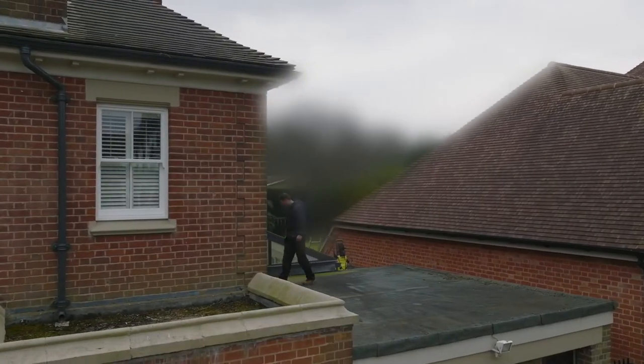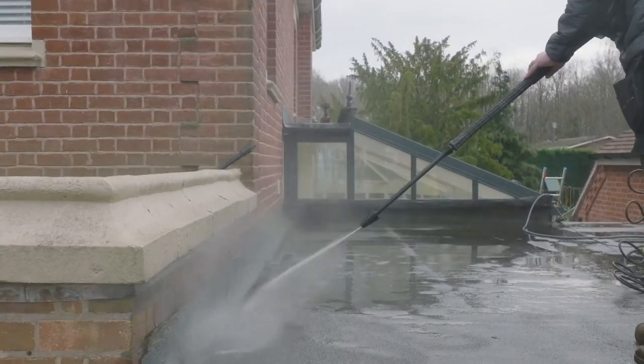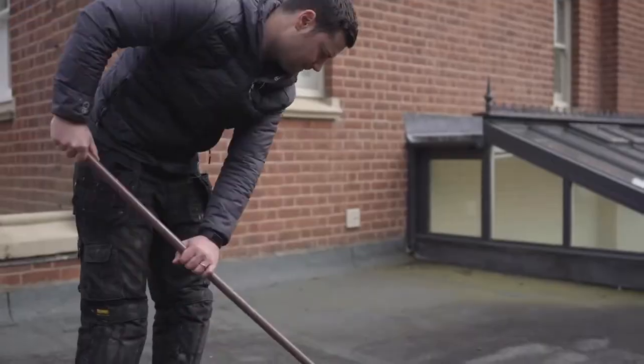The last point I'll make, if this roof was above a kitchen, or restaurants are particularly bad for this, is grease. This will stop the new system bonding to the old substrate, so this will need to be thoroughly jet washed away before you install. So while the principles apply to any new liquid overlay, watch out for the next video when we'll be fitting the new Alboflex system on this roof.